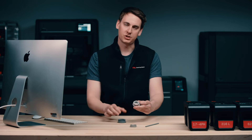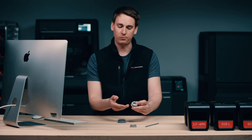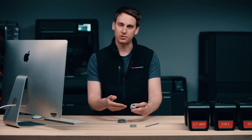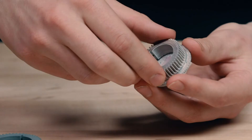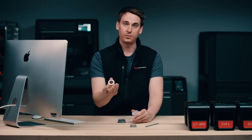What you're going to end up with is a strong metal part. Remember earlier when I talked about that ceramic release layer? That's going to make taking our raft and supports off extremely easy. After the sintering process, our ceramic release layer simply turns into this pink dust. Now all I have to do is twist our part and release it from its supports. That makes it super easy.